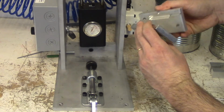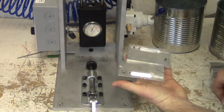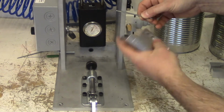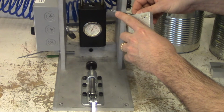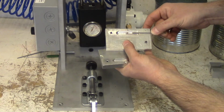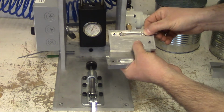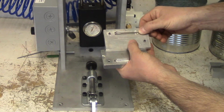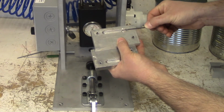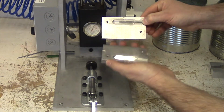So again, we're going to make our screwdriver, and I'm going to make a Phillips screwdriver today. You'll see the screwdriver blade has some embossing on it that's going to help it stay put into the plastic. Biggest mistake I see students do is they push this too far to the back, and that shaft of the screwdriver is exposed in their handle when they're finished. Or they come too far forward and the embossments are exposed. I want to try to get that just below the sprue.